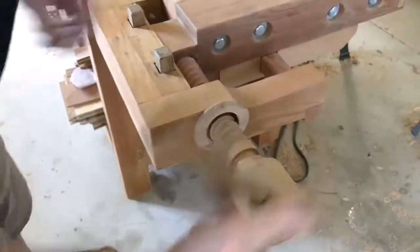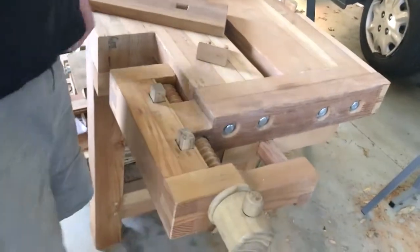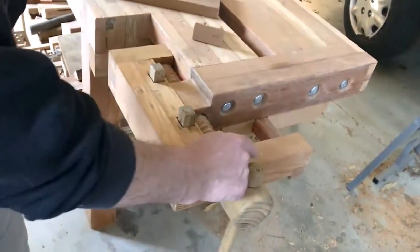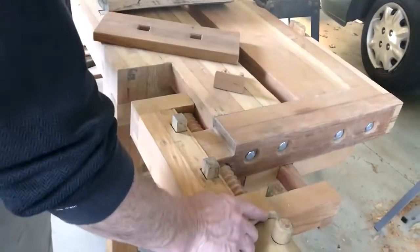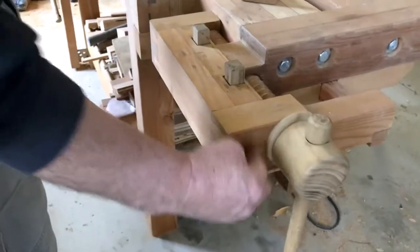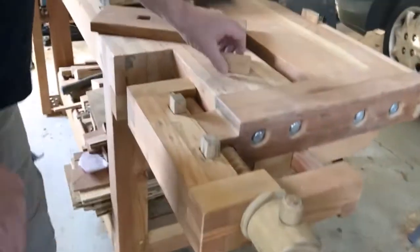My screw has two threads per inch so it goes pretty fast. The way I set this up is for the screw to push not only on the back of the jaw but also on the back side of the vise. I put a little hub — made out of eucalyptus, very hard — right here as well, because I didn't want the hub of the screw to push on the back vise jaw and gouge it. I meant to say a washer, not a hub.